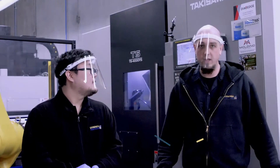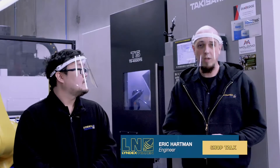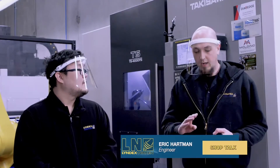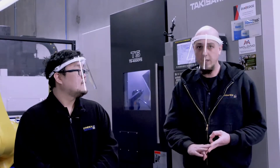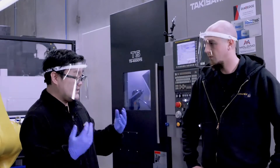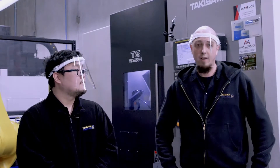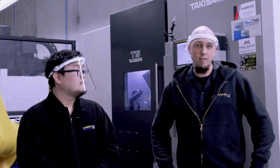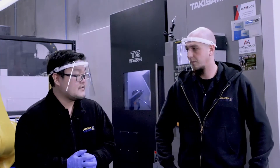So it's the same benefits that we always see out of the SK. We get higher gripping force, we get a smaller nut diameter than the ER so we can work closer to the chuck, and of course with our Ice Live Tooling we can use internal coolant, external coolant, or we can even run dry. For the test cuts we're going to be using the same parameters. We're going to be cutting 303 stainless steel using a half-inch carbide end mill, four-flute, half-inch deep, running at 2,500 RPM and 20 inches a minute feed rate. Alright, thank you Eric — let's get to the test cut.